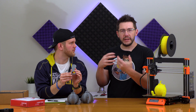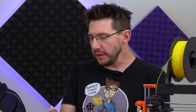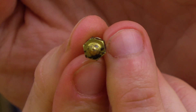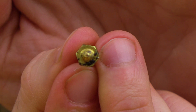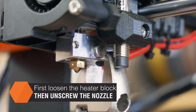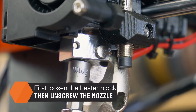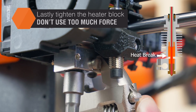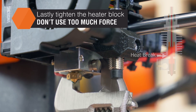So Sean and I decided to replace the nozzle. He has a hardened steel nozzle he wanted to put on. We followed the Prusa video showing how to take the nozzle off: heat it to 285°C, unscrew the heater block slightly with a wrench, then use a 7mm socket to loosen and remove the nozzle — be careful, it's hot. Put the new nozzle on, tighten it up, and tighten the heater block back into place. It's a really easy, simple procedure. If you have a Prusa machine, definitely give it a shot if you think you're having issues.